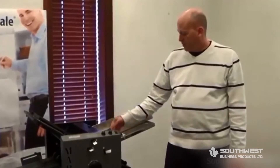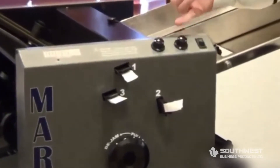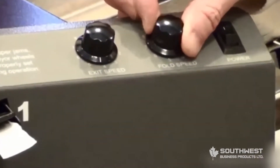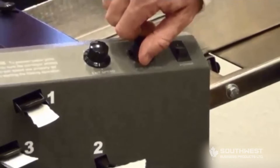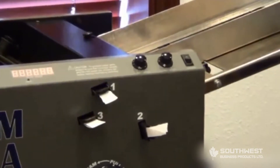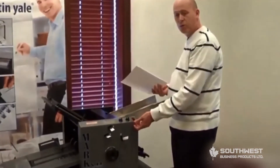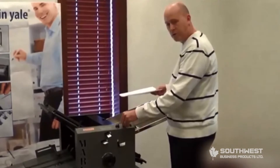To turn your machine on, you simply power the switch on. You will see a red LED counter that counts the number of sheets folded. The fold speed dial goes from 1 to 8, with 1 being the slowest and 8 the fastest — the machine starts very slowly. The exit conveyor speed is controlled separately here. With all that set, load some paper into the machine — you can place paper in while stopped or drop it in while running and it will continue to feed — then power it up and set the speed.